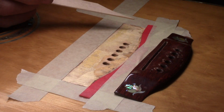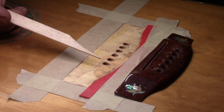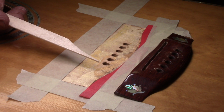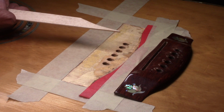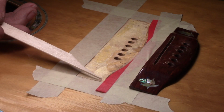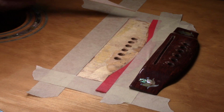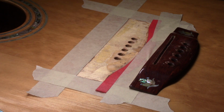So because it was wood glue instead of epoxy, I went with a shorter heating period of 3.5 minutes with that 250 watt bulb, as you saw, and then gradually coaxed it off with these wedges. Ready to just kind of clean this up very carefully, very gently, clean that surface up. Heat up the wood glue and glue this into place.